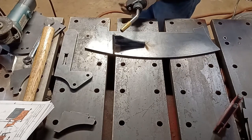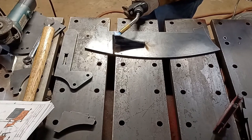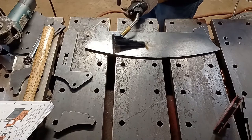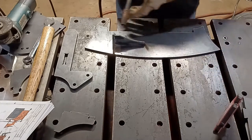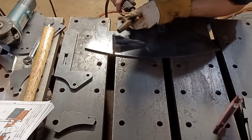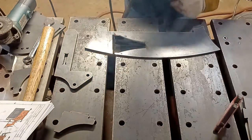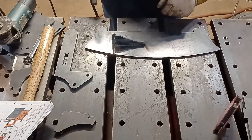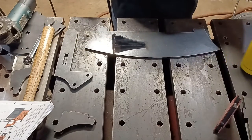If you only have a 120-volt MIG welder, you will probably need to preheat the 3/8-inch thick plates — you're not going to have very good luck with a small welder. But if you preheat it with a propane torch, it'll absolutely weld amazingly. This weld right here is going to be basically the same as if I had a really powerful welder — I just preheated it. That's how you cheat: if you've got a little welder and you want it to punch above its weight, just preheat your metal first. That is the trick.